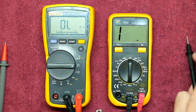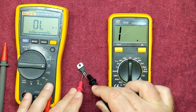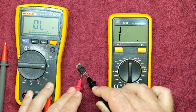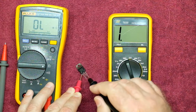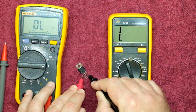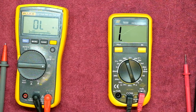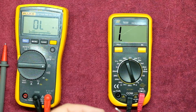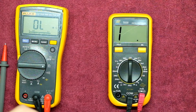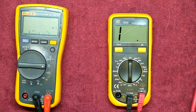On a TIP41C transistor, if you wanted to test it with this meter, we shouldn't have any issues. This is an NPN transistor, so we go base to collector — we've got 0.6 there — and base to emitter — 0.6 there. Coming across collector to emitter we've got nothing, and reversing we've got nothing. Happy days, everything works out quite nicely. For low resistance, I'm not expecting anything phenomenal — the TopTronic gives 1.3 ohms while the Fluke registers a solid 1.5 ohms. Much of a much.